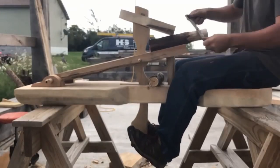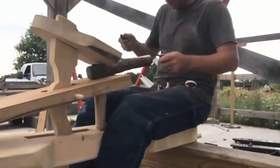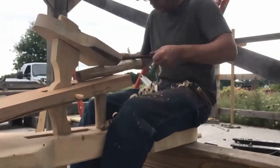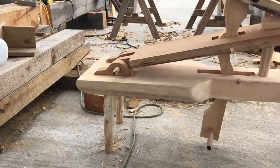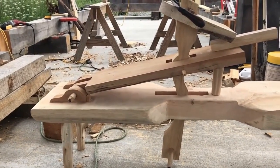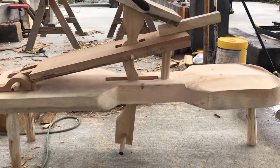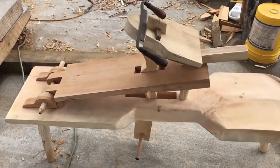This is a shaving horse I made a while ago and have since revamped. The shaving horse is one of the handiest things to have if you have a draw knife. Right there is a good example of making legs for the shaving horse. You can also make pegs for building a log cabin — pegging the logs together so they don't bend and crown. Draw knife is definitely an A1 important tool to have on your list.